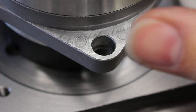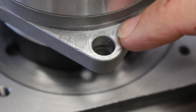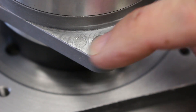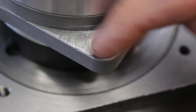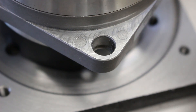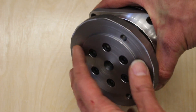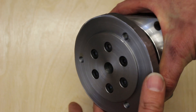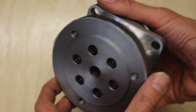Off-camera I took another very light final skim cut and then stoned it lightly to remove any burrs. It still looks a bit rough with some mill swirl marks and dimples from the die-cast, but the surface is actually very flat. I have a nice flat reference surface on each tab and it should be exactly in a plane perpendicular to the axis of rotation. I went ahead and trimmed the faceplate approximately round on the bandsaw and it fits on the harmonic drive really well.